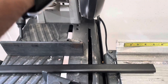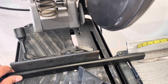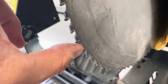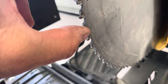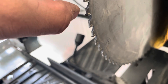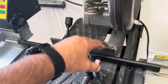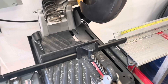You have to have your parts securely fastened. If the piece vibrates back and forth when you're cutting, we found it will break the carbide tooth off the edge and won't allow it to cut properly — it's got to be a nice, smooth, steady cut. If it's not, it either breaks or knocks the carbide teeth off. Your sharpening guy can re-tip them, but if you do a couple of them it gets pretty expensive. So everything has to be clamped nice and tight, and it works really well.